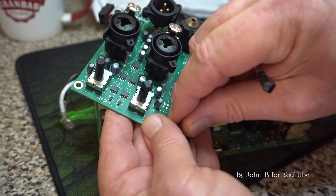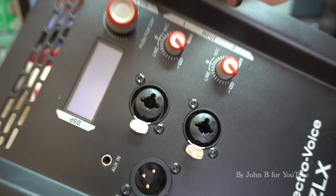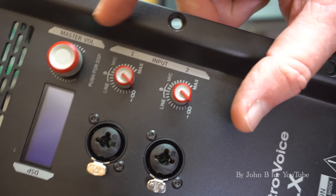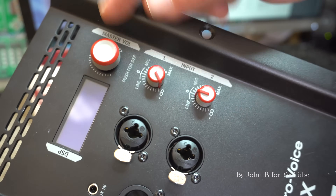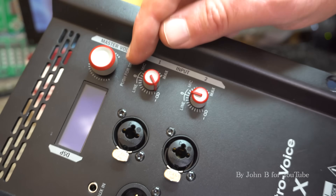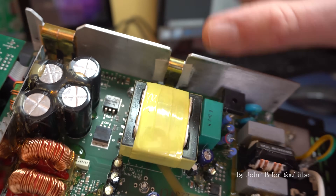The DSP drives the LCD display too, with a few op-amps. I think we've got master volume, which feels like a rotary encoder. Then there's line and mic — push for DSP, which also feels like a rotary encoder, that's quite smart. Line and mic level for input one and input two. Presumably you adjust all the DSP through one knob, which is a lot of faffing around if you just want to increase bass or treble. You have to go through a menu to find it — there aren't individual controls like on the Thump. In that sense the Thump is better, although some people will want the LCD display.